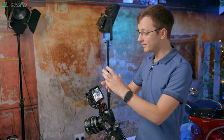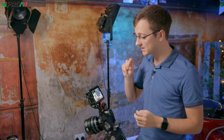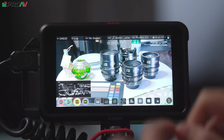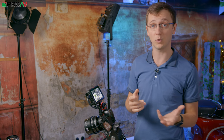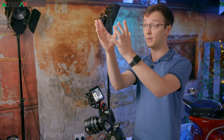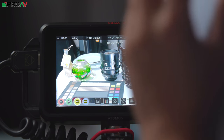Overall this really has simplified the UI. It all feels much more responsive and easy to use, and speed is the main thing they've improved here. I've been after simple one-touch buttons at the bottom to toggle things like waveforms on and off. Previously you had to go into the menus and it took a couple of presses to turn on and off your waveforms, which is something we do all the time. We've got a big Atomos Sumo here and a Shogun Inferno, and we're constantly toggling on and off waveforms and peaking tools, so having them on quick little buttons is incredibly useful.